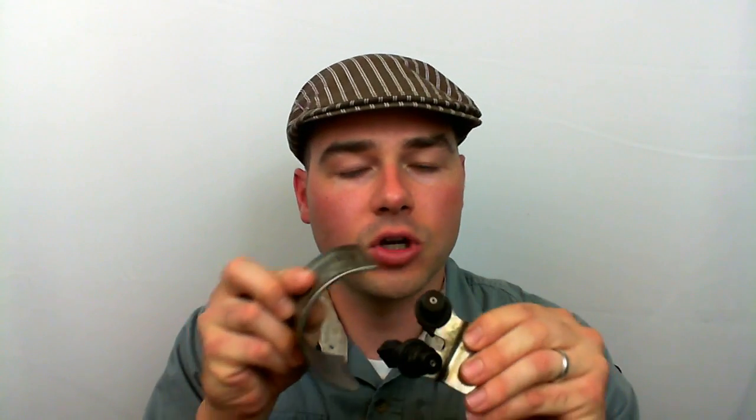You can pretty much always ohm out timing sensors, and the reason is because they're all pretty much the same — they're magnetic and have a coil inside. You're also going to look for any debris on the tip since it's magnetic. If it ohms out incorrectly, or the wiring to or from them is bad, that can cause all the problems already discussed: fail to start, engine misses — especially on older ones where they only had one timing sensor. Check these — they're relatively cheap too. I wonder how many engines have had new fuel pumps, injector kits, and all sorts of stuff replaced when these sensors were the problem all along.